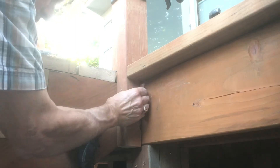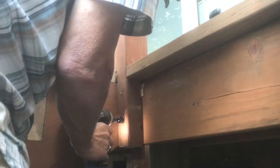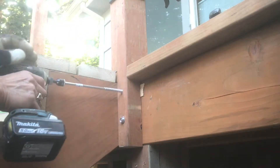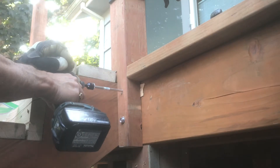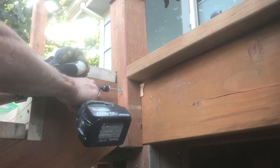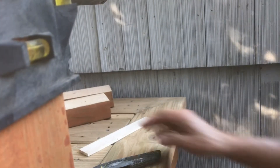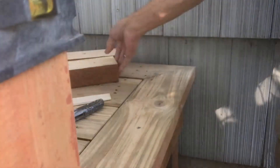Come on, get out of there. So I've got a little thin piece here I'll put back there. When it sucks up, it'll be level with the front of the deck. We're driving that down and it's grabbing. This post has got some beef on it. The fact that I cut out around that fascia — that top deck where it overhangs — that gives it just that much more support. If you have just a square face and don't have your deck board hanging over, you can wrap it around there without having to do that. But I wanted that extra support sideways, and so that's the way I made it. That's kind of like a picture frame deck.